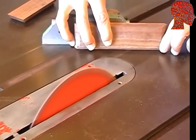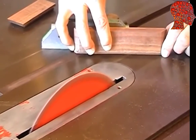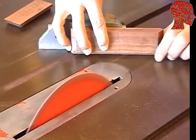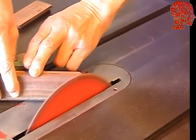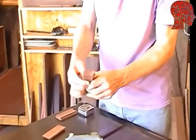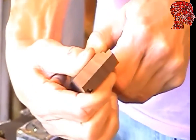And at this point, I use my finger or fingernail, and you can feel if there's a little bit, it's not quite ready. So now it's just a hair that's going to come off. But you can't really see either side of that. What you're seeing is the point where the two miters meet. So that means they're the same length.